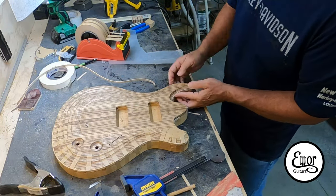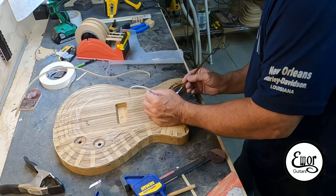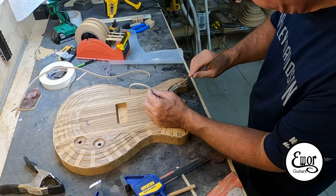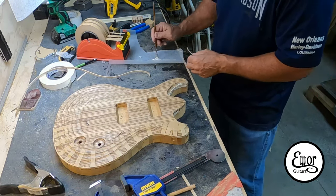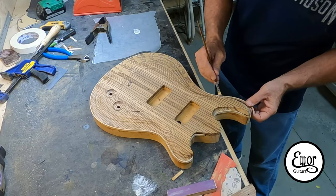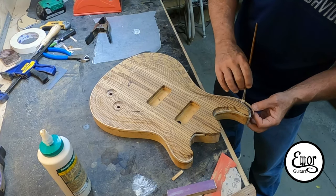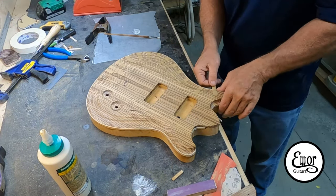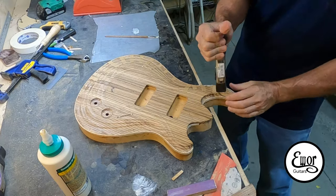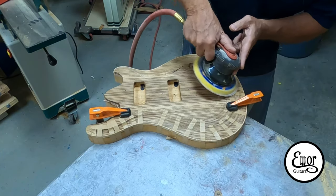Here's the first piece of the second side I'm putting in, after I fit the ends and figured out how I was going to get it to sit in there. Same deal — I'm putting a little bit of glue on with my brush. You don't want too much glue dripping out when you're working with that tape. I had to router it out first before putting on the binding so the tape can hold it down. After the first piece dried, I glued in the second piece, getting it to fit good.